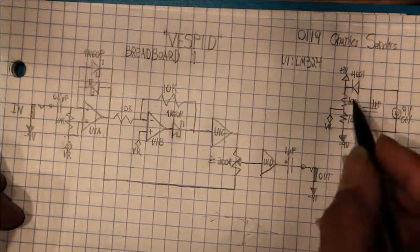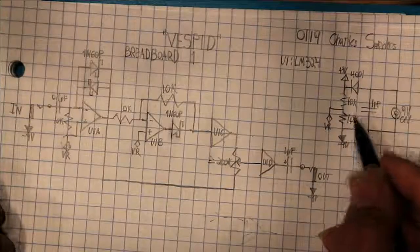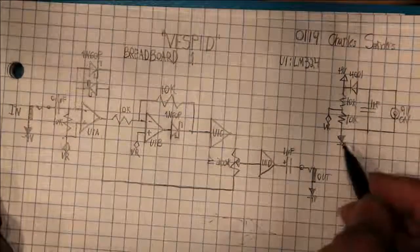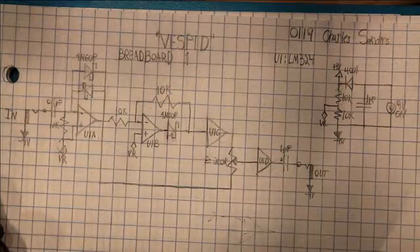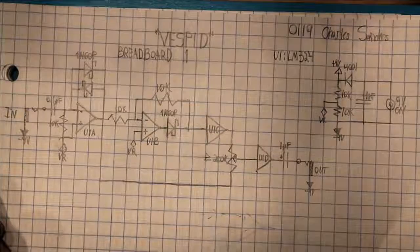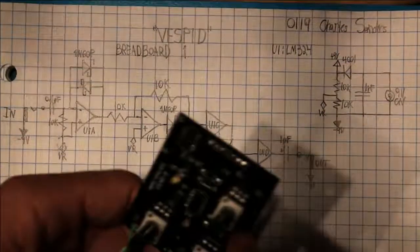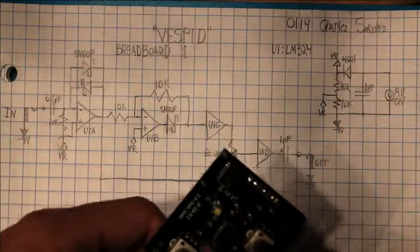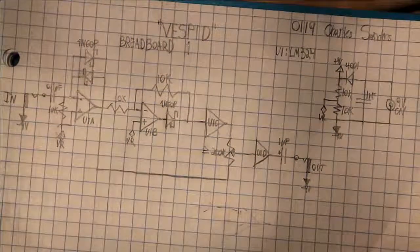And of course you've got this resistor divider generating our reference voltage. So these are both 10k. These were originally 1k on this circuit right here. These are 1K, but 10K also seems to work. And this had a sort of tremolo effect too. That's why you see two chips and extra knobs. But I'm getting it down to just one knob, which is really cool.